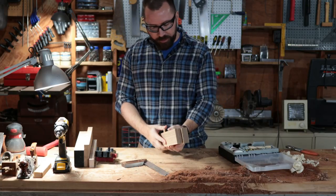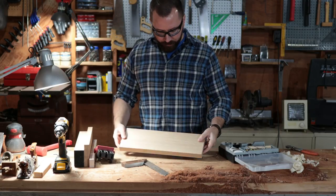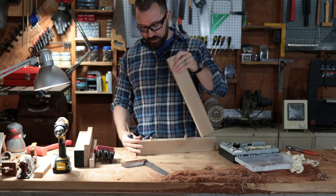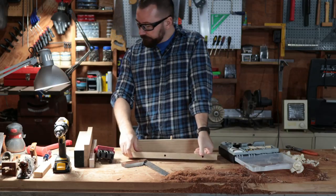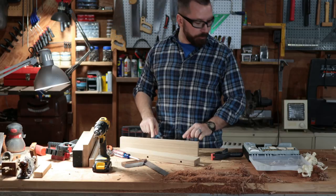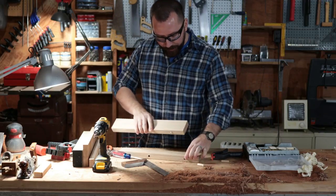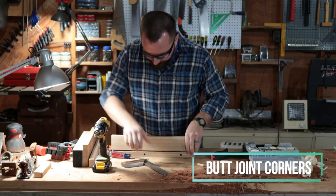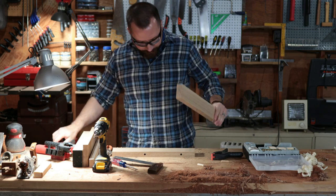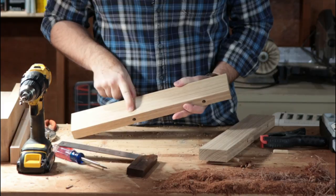Just like that. It's not too bad. This is oak, so it doesn't have a lot of flexibility — so if it's not nice and square and even, it's not going to go together well. So that's a good sign. Another method you can use: you have your end drilled here, you can get your little centering posts, stick them in there, and say you want to make a box where this is going to go down like this. You can get it leveled up so it's nice and even, give it a whack like that, and you have some marking holes right here that tell you where your holes need to be drilled.